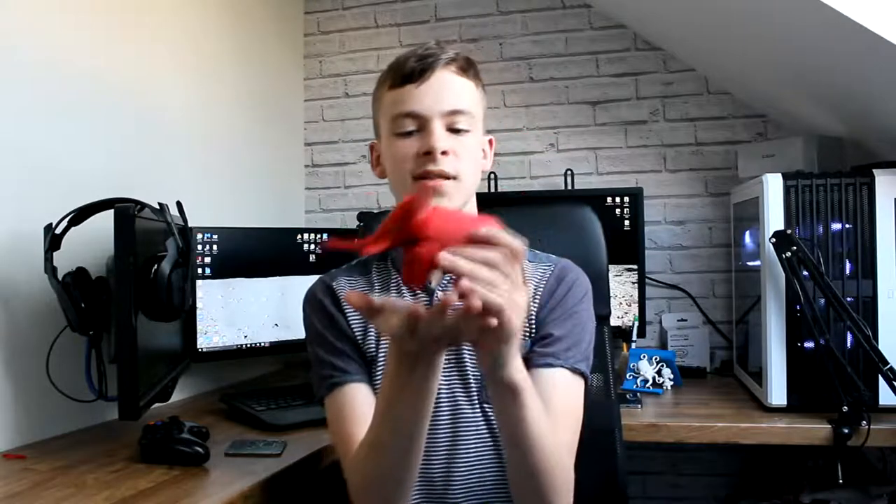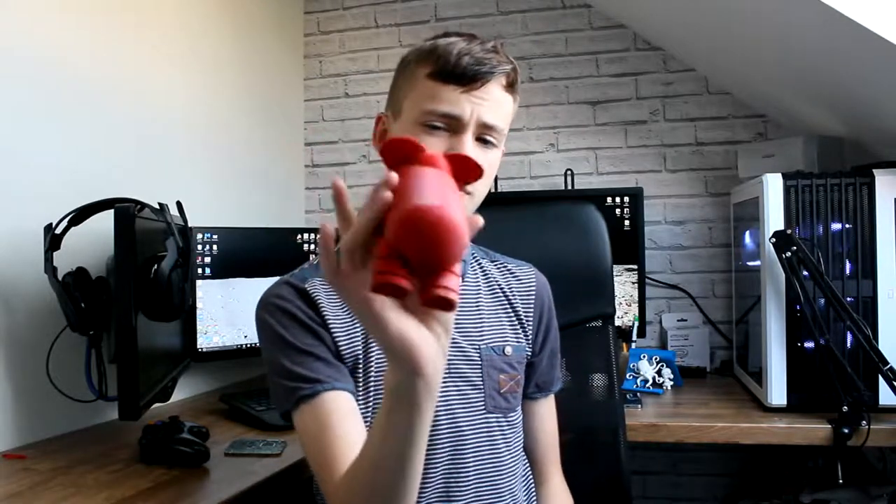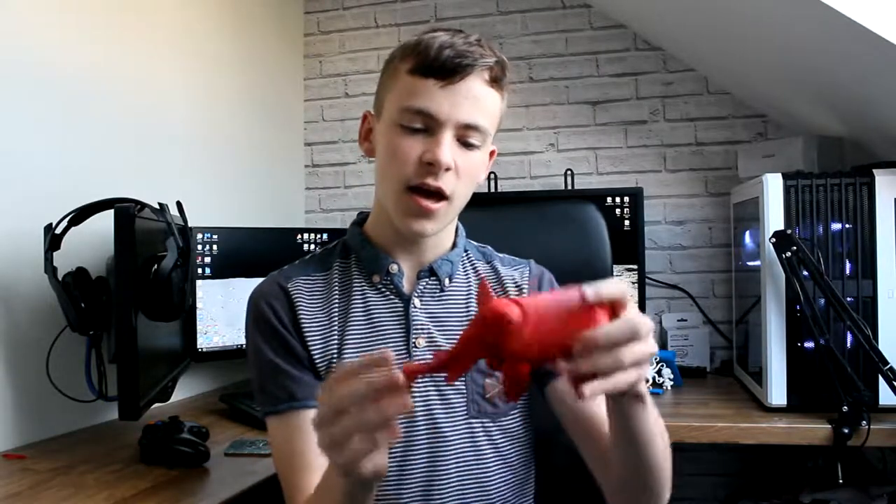Let's go to the downsides of the Wanhao. I made this using Slic3r. This is the Elephant MakerBot model — link in the description if I don't forget. Because I wasn't able to use support, it has a few problems. Overall it's a decent model and it looks fairly good from a distance. However, the second you turn it over, you can see that the overhangs have significant errors with them.